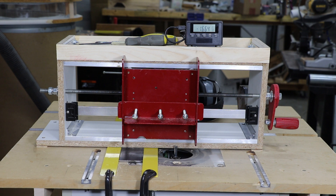Your workpiece clamps to the carriage, which can move left and right with the aid of the screw and crank. A digital readout is attached to the carriage to indicate the relative carriage position left and right. There is also a center guide bar at the bottom of the box frame that allows the fixture to easily move fore and aft between the two yellow bars that are clamped to the router table.